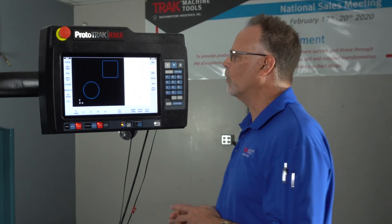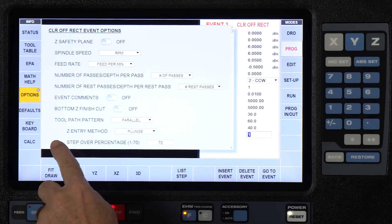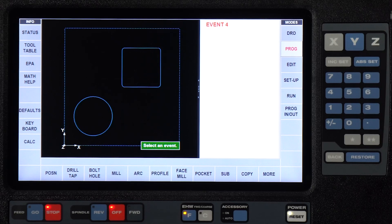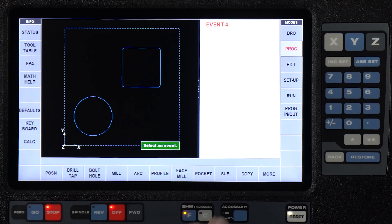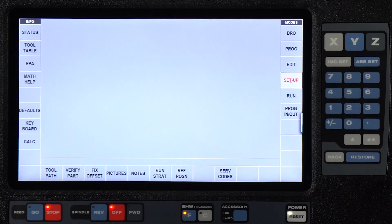Before I go any farther, I want to explain a couple of things. If I open my options page here, you're going to notice that I have my toolpath set to parallel. I can change this for any different thing, and I'm going to use different toolpaths for each one of these samples, but I just wanted you to see where it's set right now. Another thing I want to point out is my entry method doesn't really matter because it's only going to bring the tool down where there is no material, so it's going to default to plunge anyway. I'm going to close that and just use tool number one for both the rough and the finished part of this. There's my completed part — you'll notice it looks a little different because I've got solid blue lines showing my profiles and dotted blue lines showing the actual material and where it's going to start to remove. So I'm going to go to the tool table and look for a tool I can use to remove the material.